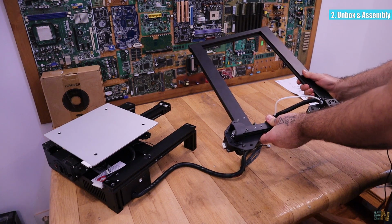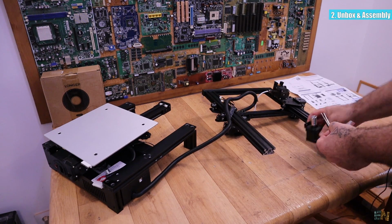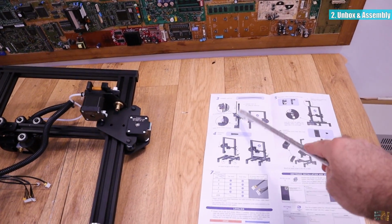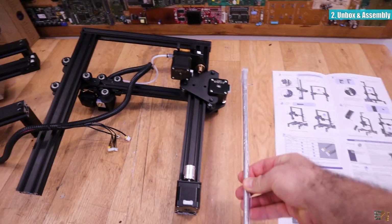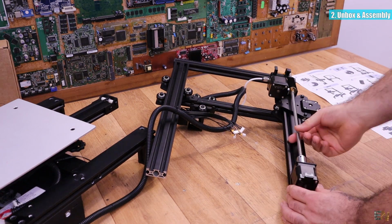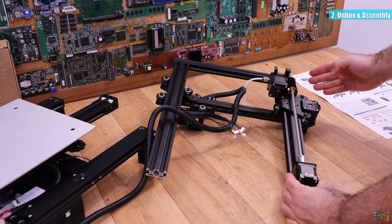So just roll this in. Oh, that's very smooth. We have the step motor. So there we have the motor. Okay, so step 3, as you can see here, of course, is to add the lead screw between the motor and the Z-axis. So there you have it. Now when the motor moves, it will lift the axis up and down.